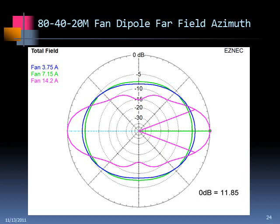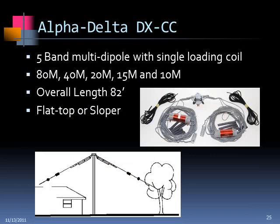The problem is getting all of the wires to work together well. The patterns tend to look like dipoles on the bands where you have dipoles cut. Being a dipole, it has pretty good high gain — about 11 dBi on some bands and probably 6 or 7 on the others. So they should be pretty good performers as you would expect.